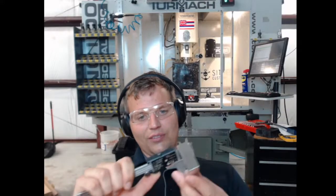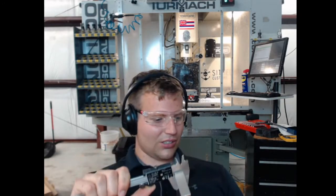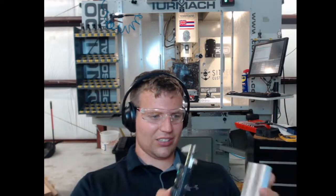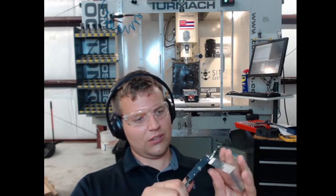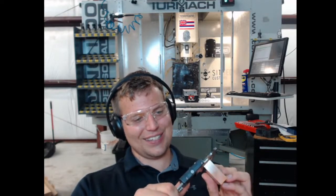So interesting that the Z is not quite right. So we must have not quite measured off the parallels. I'm getting 0.7465 on this one. 0.746. So on the back side, it's good. It should be good all over. 0.745, that's technically in spec. Okay.